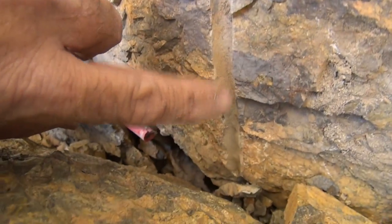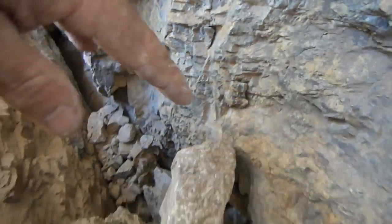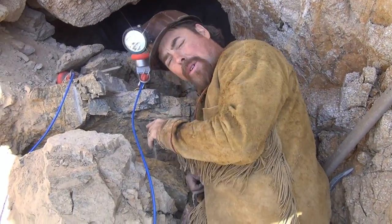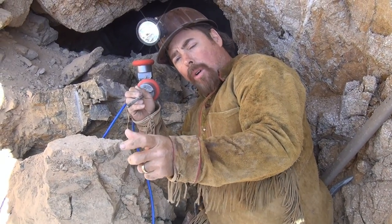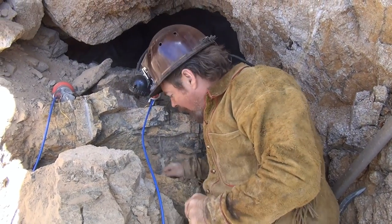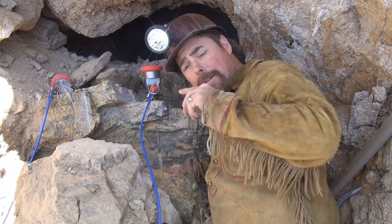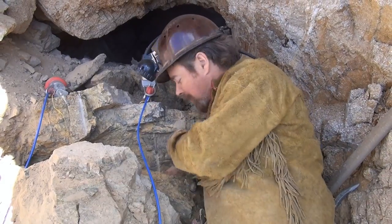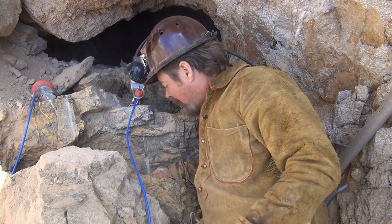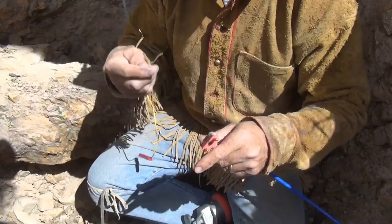There's my bore hole all the way down — it almost popped out the bottom, so you've got to be careful. You can see where this one fired, see where it's empty. You fractured this rock beautifully. Now, another thing: if your rock is deeper than these blast rods, you can put boosters in the hole to compensate for the depth. In this hole, I actually put two boosters in there. Also, if your rock is really big, you can put water in the hole — that will amplify the blast force and the compression wave. Your hole being deeper than the rod length is solved with two boosters, and I'm going to show you how to do that.